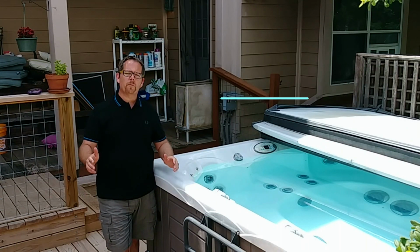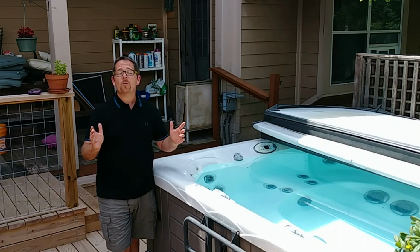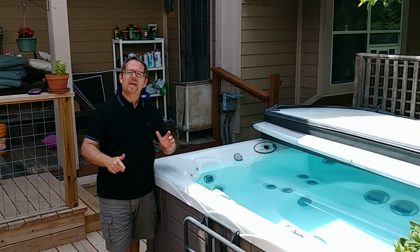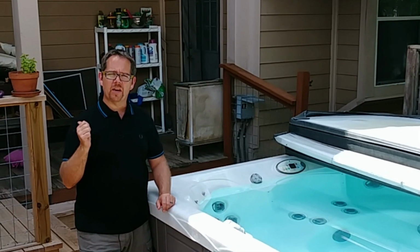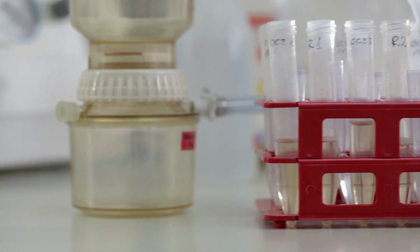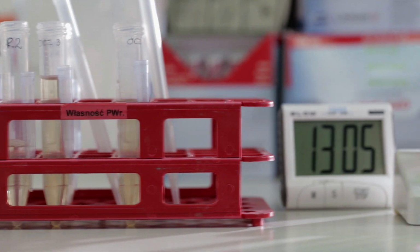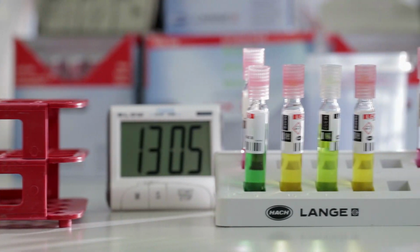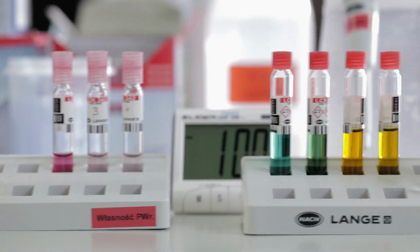But before we talk about raising your alkalinity, what is alkalinity? And what's the difference between alkalinity and pH? We're going to get into that last one a little bit later in the video, but just know that alkalinity is the ability of the water in your hot tub to neutralize acid. Ultimately, pH is a little bit more important than alkalinity, but if your alkalinity is off, you'll never get the pH right, and that's not safe to soak in.